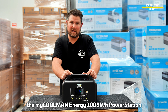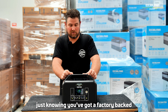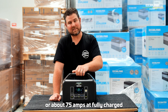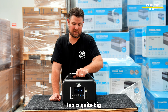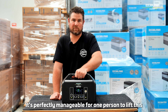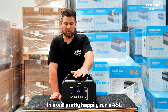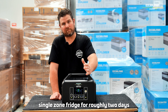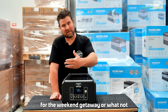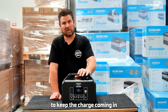The MyCoolman Energy 1,008Wh power station comes with a full three-year warranty — important for peace of mind, knowing you've got a factory-backed three-year warranty on this lithium power station. This unit, being 1,008Wh or about 75 amps fully charged, looks quite big but is actually a pretty simple one-person lift. It weighs in at around 12 kilos, just under. Without solar coming in, it will pretty happily run a 45-litre single-zone fridge for roughly two days before it's flat. And if you add one of our solar panels to keep the charge coming in, you can almost stay indefinitely.